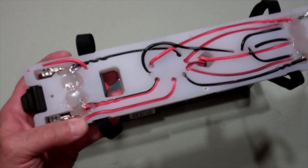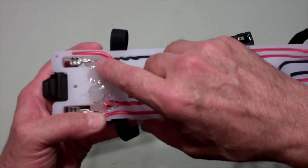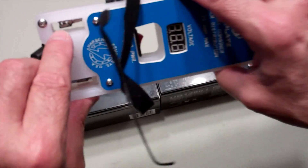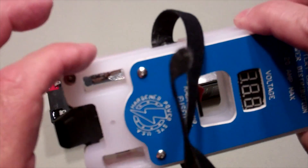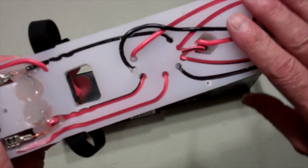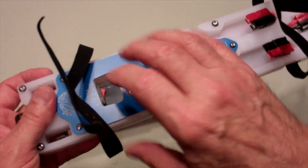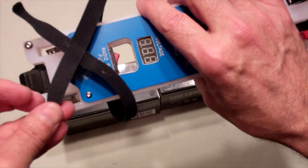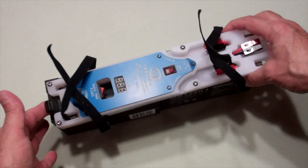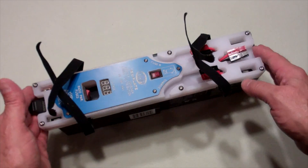We were having trouble at the connector right here, and what Bill did is switch out the stranded wire to solid wire, which has been very helpful and works well. As long as you slide these on and coax those connectors on through the top plate using a flat blade screwdriver, gently move it on and secure the Velcro straps, you should be good for a long service. It's very well done — all CNC machined with stainless steel screws and heavy duty connectors. When putting the tech plate on for the first time, take your battery straps and put them on top of the plate and cross them to keep them out of the way while attaching the batteries. Do one end then the other, using the flat blade screwdriver to access down through the top corner to guide those connectors on.